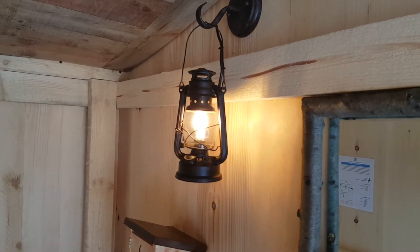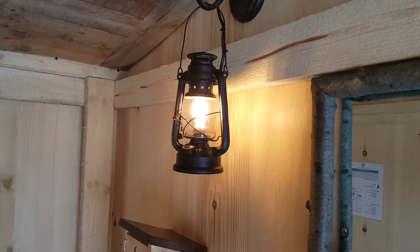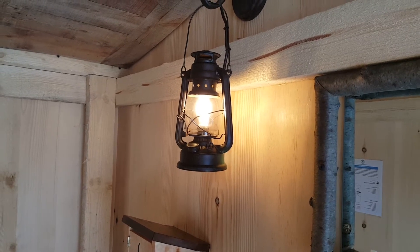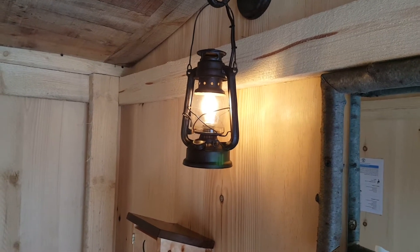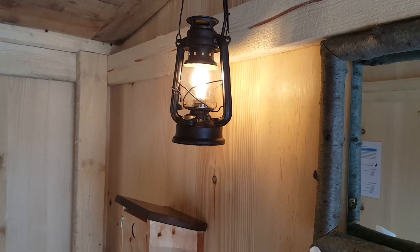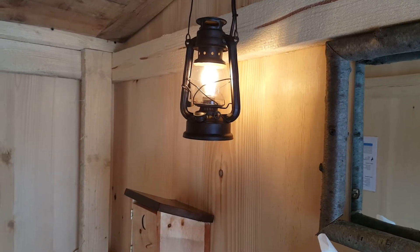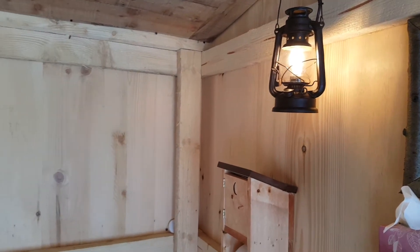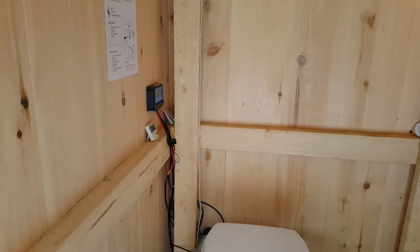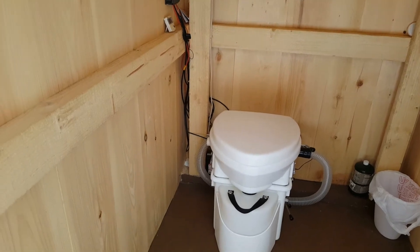For the light, I did something a little bit different. I actually found online an LED bulb that is 12 volts. So it's a 12-volt system, so I didn't need an inverter. That's nice because you don't have any of that loss when you convert from 12-volt to 120-volt. I'm able to just run right off of solar and a battery and run a 12-volt LED. I'm just running a little motorcycle battery in here right now — I'll show you the solar setup in a second. I'm probably going to need something with more capacity, but since it's the winter I'm not really running the fan inside the composting toilet.